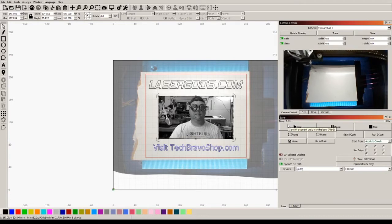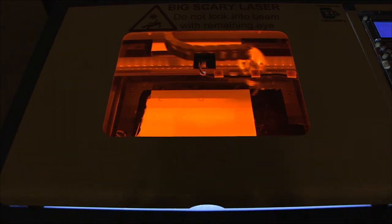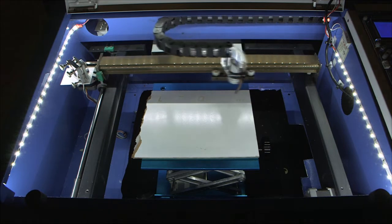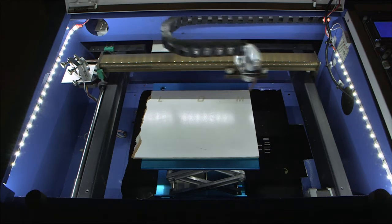So let's just go for it. I knew that stuff was pretty tough. This may be a real good candidate for masking it, etching it, and then doing an infill with paint or stain, since there's a veneer on there. I don't think it would bleed underneath and you'd have really clear lines. Let me open this back up so you can see - it's actually cutting through and getting to the wood, there's just no contrast. White on white - I'm not hitting that MDF hard enough to actually char, I'm barely getting through the surface.